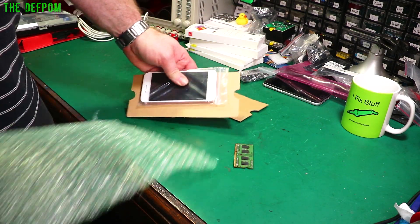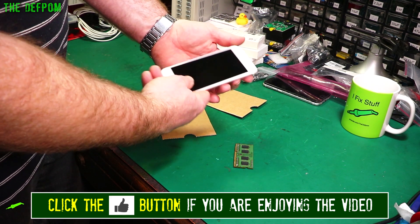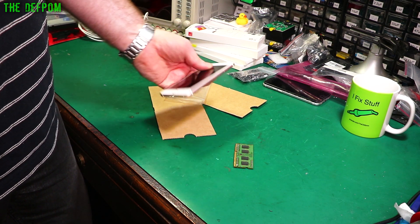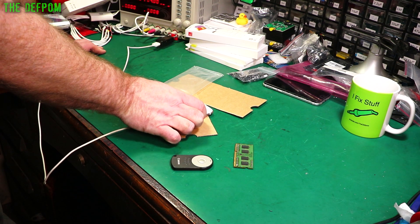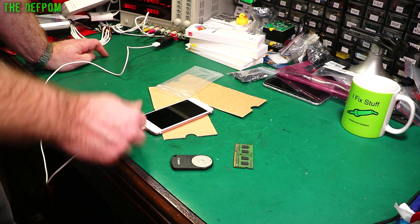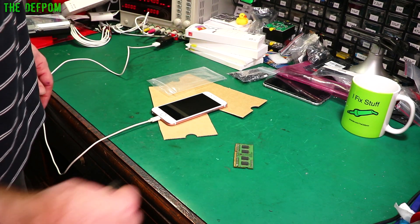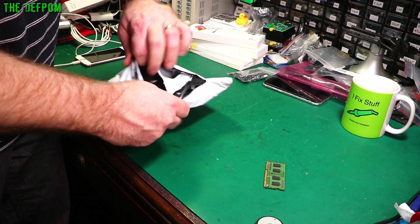Wow, that's not a lot of packaging for a phone. So this is a phone I've purchased for $40. I don't know what's wrong with it — doesn't even turn on, dead, as expected. It could be completely dead, it could be a parts phone. It's going with the whole thing of trying to get some iPhones to fix. Let's plug it into my power supply over here with my little USB meter. It's not doing much at all — it did cycle a little bit, about 300mA down to about 70mA, cycling backwards and forwards. Nothing on the screen I can see. I think it's probably completely dead. I might chuck it on charge a little bit, leave it sitting here and see if it comes right. It could be a liquid damaged phone — I really don't remember.